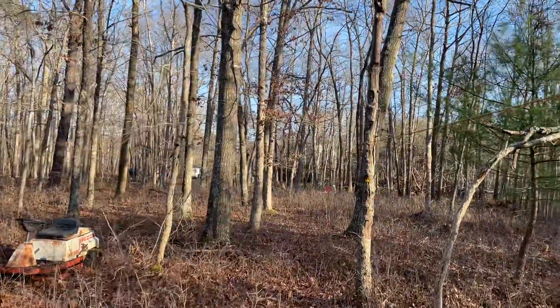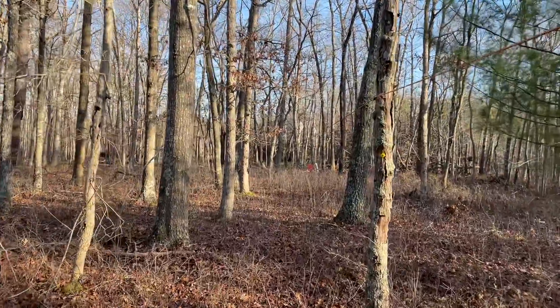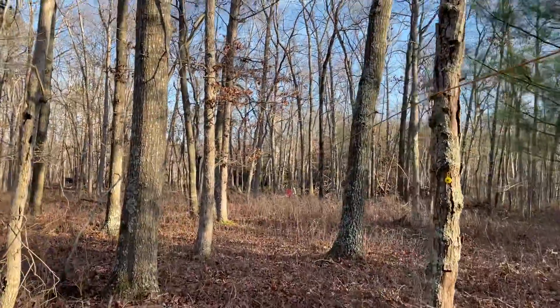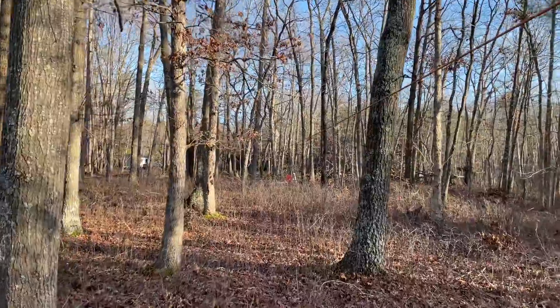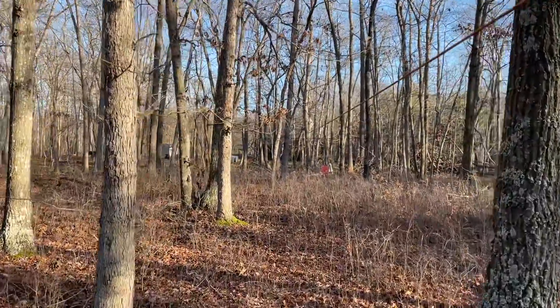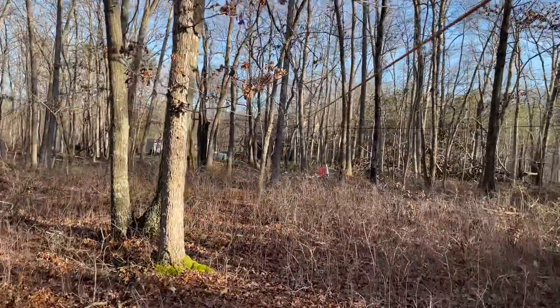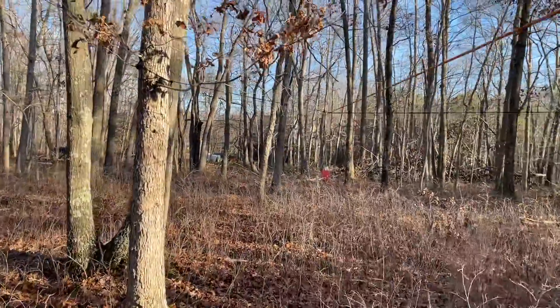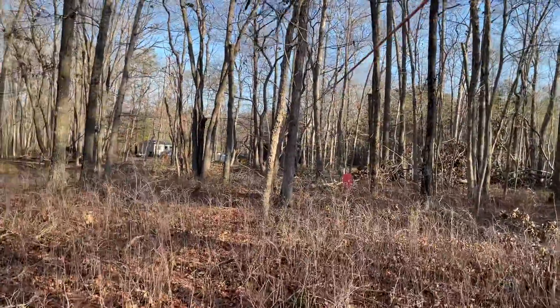Because what you're really looking for is the signal to noise ratio. An S9 noise floor with a 10-over signal, which is pretty strong, is pretty hard to listen to. But an S5 signal over an S1 noise floor is very pleasing — that represents good signal to noise ratio. We're approaching the feed point of my east-west beverage, and I'll give you an example of how the BevFlex is a very unique design made out of RG6 coax.